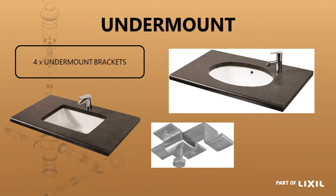You've also got undermount basins — there are four of them. You've got one oval basin which is a standard one, the President basin, and three rectangular basins. These four basins all use exactly the same brackets to attach to the underside of a surface. If you have a marble or granite slab, do not screw the bracket directly into the slab. You would need to put a piece of plywood attached onto the underside of the slab and attach the bracket onto that. Don't drill directly into it because you risk it cracking.